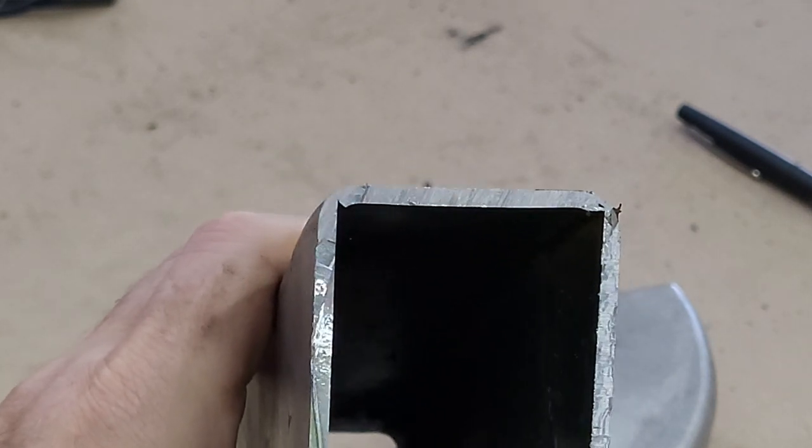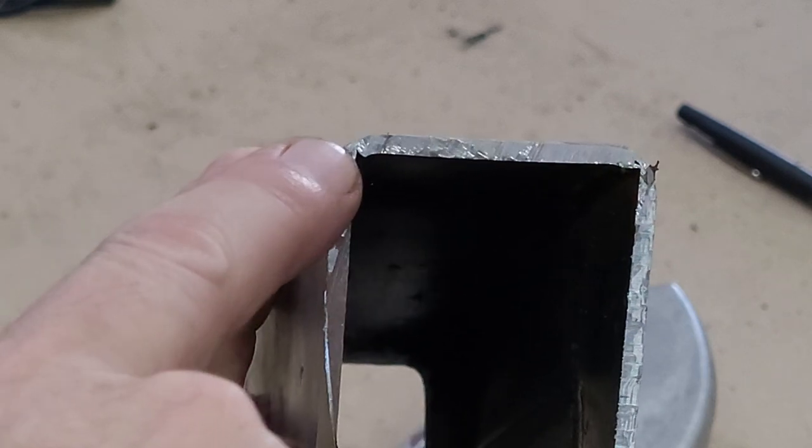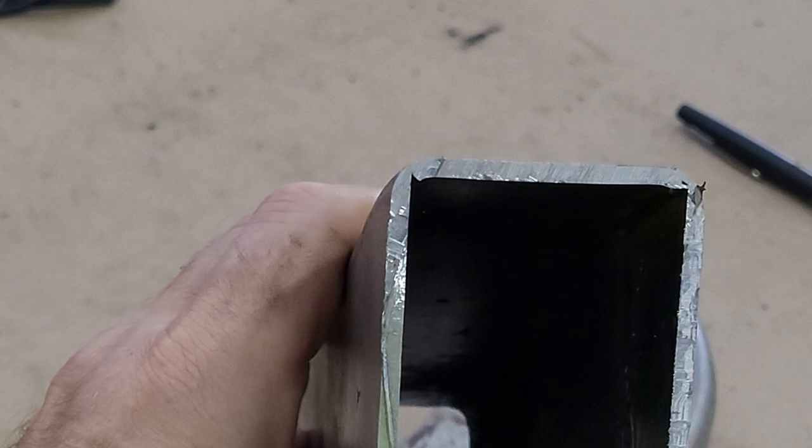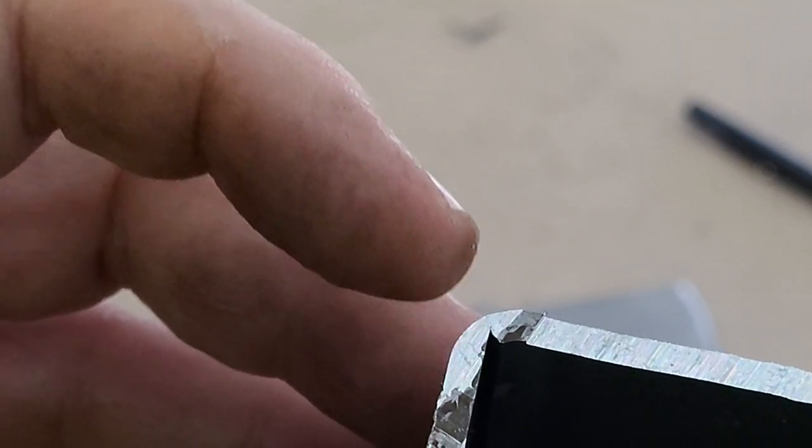I think that was probably cracked right there, right in this corner, because when I was grinding it, it seemed like it was lining dust up in a way that you would with a Magna-flux machine. And it looked like there was a line here, and now that I can see how deep that little crack is — there is a crack there, I'm sure there is. So the frame rails are garbage, right?